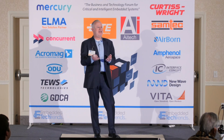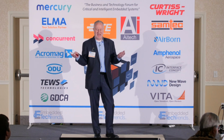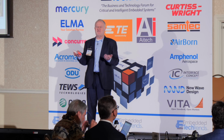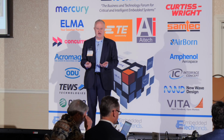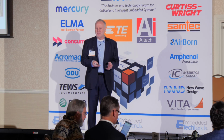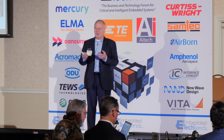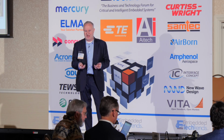Jan was mentioning with Ethernet, you could go up to 10 gigabit Ethernet. You've got serial communication, avionics like 1553, ARINC 429, 818. We also support industrial protocols like CAN bus, and also FireWire, SpaceWire, different things of this nature, high-speed USB interfaces. And with those high-speed connectors that we put on there, we also want to be able to support more powerful FPGAs and GPUs and video interfaces as well.